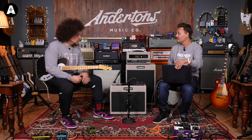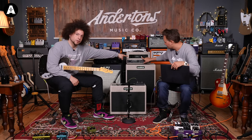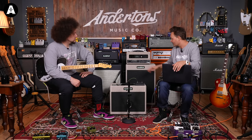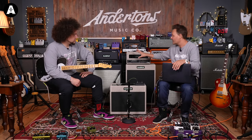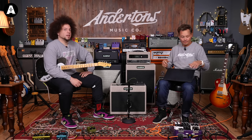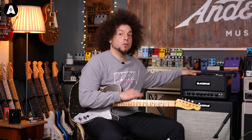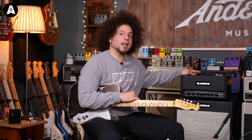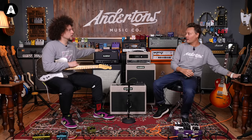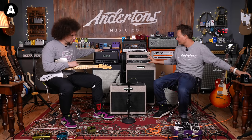I like them. It also has a fan in it, in case it gets too hot, which just comes on and off. You were talking earlier about the input stage of it. Yeah, I was curious because there's a lot of gain in this one, but there are only two preamp tubes, so I was thinking, how are they getting that much gain out of it? Does it have a solid-state front end that then drives the preamp section? Yeah, it's an op amp buffer in the front end of the amps.